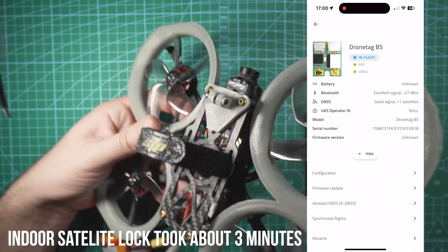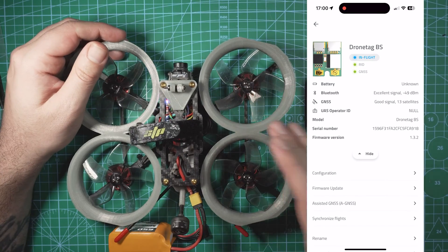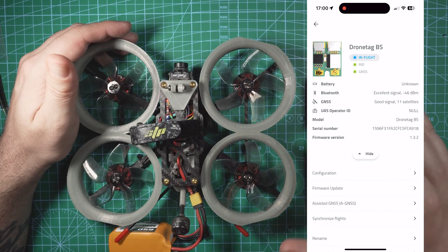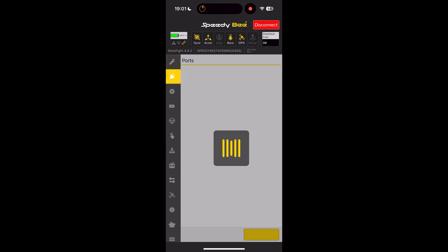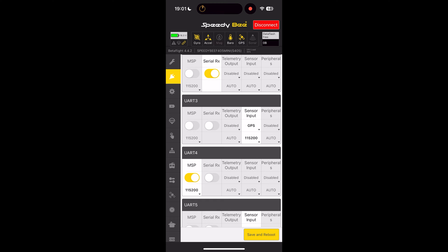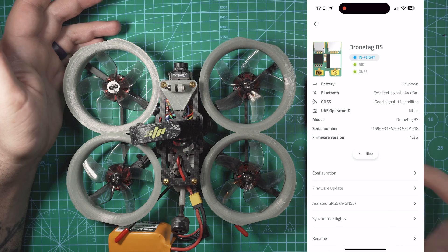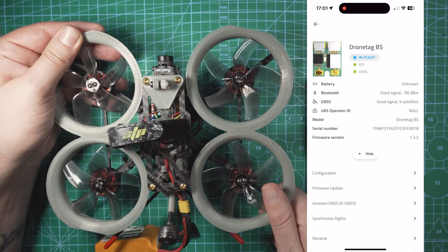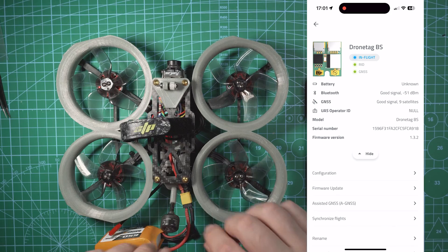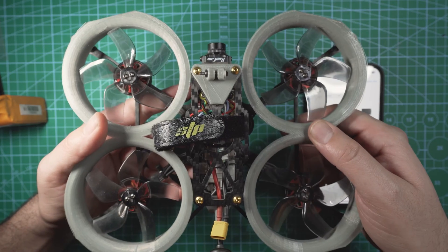I just got satellite lock — we can see a flashing white LED on the module. Once you have a white flashing LED, that means the BS module is being seen as in-flight and it's broadcasting remote ID information, and you will have GPS going into the flight controller. Setting it up as a GPS is pretty straightforward, just like a regular GPS: select what UART you installed it to, scroll down to GPS, turn it on. You can then take your serial number and link it to your FAA profile, associating this remote ID module with your drone registration. And you will be all set — you won't get arrested, you won't go to jail.